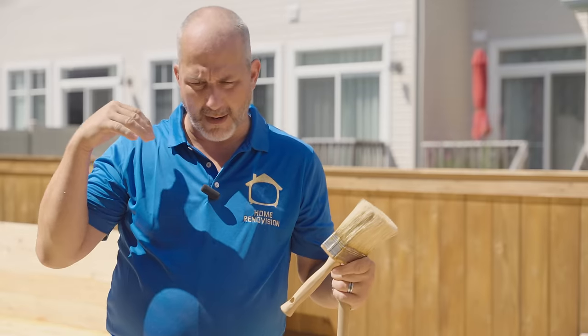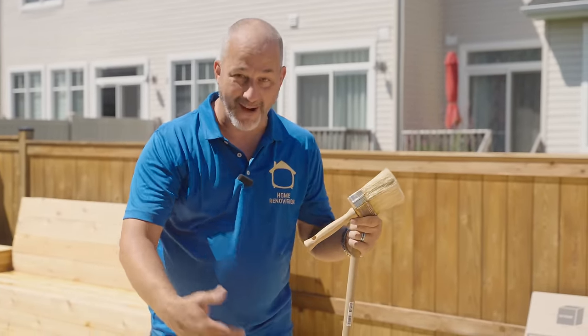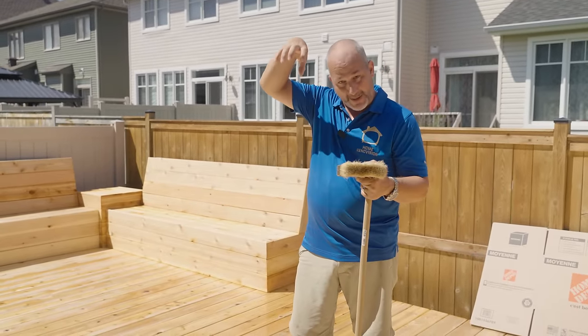It is a hot day today, so using that pressure is very important. And you want to make sure that about every 3 minutes, you go back and you recoat what you just did. So you've got to be careful you don't do too much flooring and then you're kind of walking on it, right? That's the problem. And remember, this stuff does not skin. It does not stay on the surface of the wood. It penetrates into the wood.